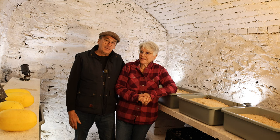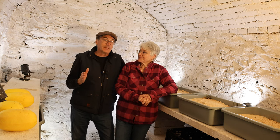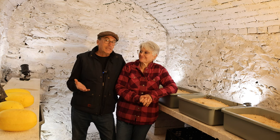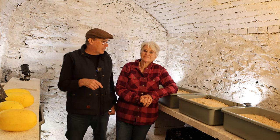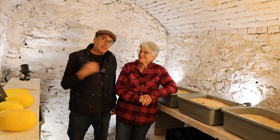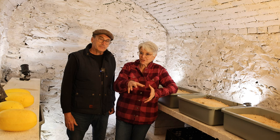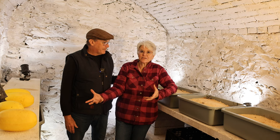Anytime it was really cold at night, we ran the blower for a longer period of time to put cold air down here. What we learned is the root cellar is great, but we still have a transition period in the fall — when produce comes out, the root cellar is still 55 degrees. If we power both vents, it cools the rocks down. We also learned from reading that when you pick the produce, put it in the refrigerator for a day or two to bring its temperature down before putting it down here, otherwise you're putting 70-degree food into the room and it might warm it up.